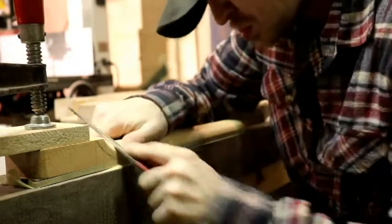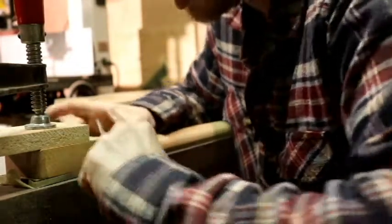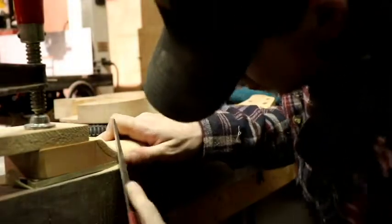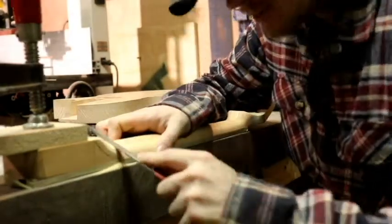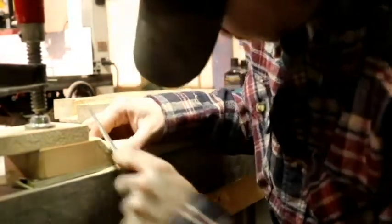The other rasps would be quicker, but this is brand new. I like it. The Iwasaki file cuts really nice, actually. It's a really cool cut. As opposed to a rasp, my other rasp feels like it wants to rip material out sometimes. This one doesn't. It just wants to skate across and take off the same amount each time. It's a pretty consistent, cool file to use. I gotta get one that has a radius, but for now, I just have these two.